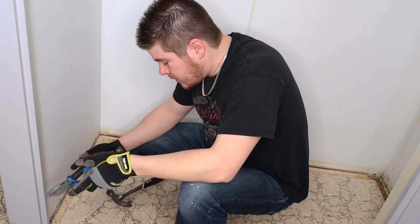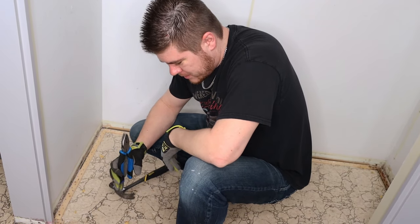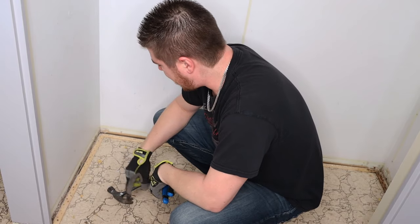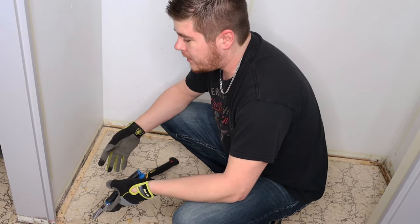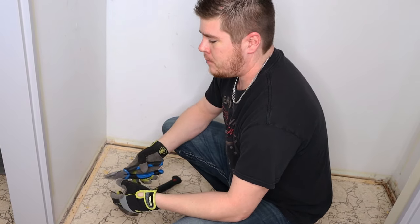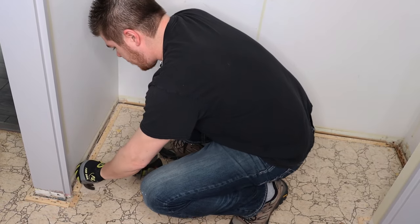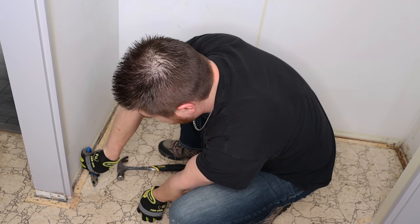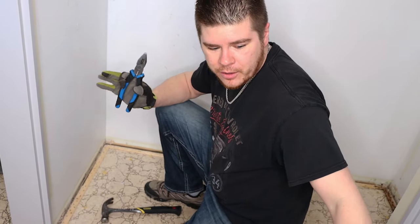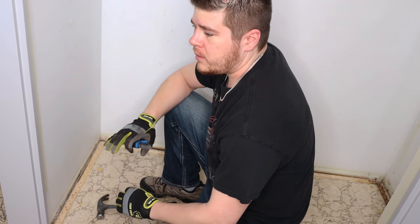Normally under your carpet you'd expect to find plywood subfloor. In my case, I'm still finding horrendous tile throughout the house, but that doesn't matter. What we're after are the staples all along the edges that were holding in the underlay. You're not really going to find those throughout the center of the room — you may find the odd one where two pieces of underlay met up — but generally you'll find them around the perimeter. I like to take my hammer, scrape along to find them, then use a pair of pliers to peel them out of the floor. Once you've done that, give the entire area a good vacuum with a shop vac — make sure you pick up all the staples you may have missed, all the junk and dust that was under the carpet, and get it all nice and clean.